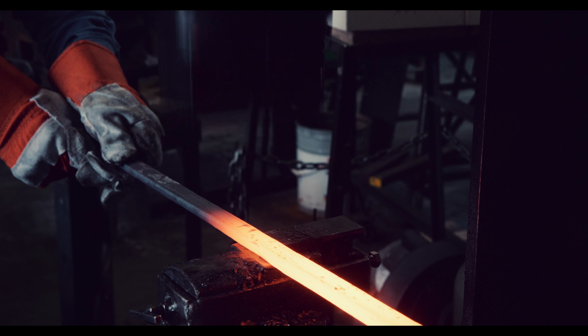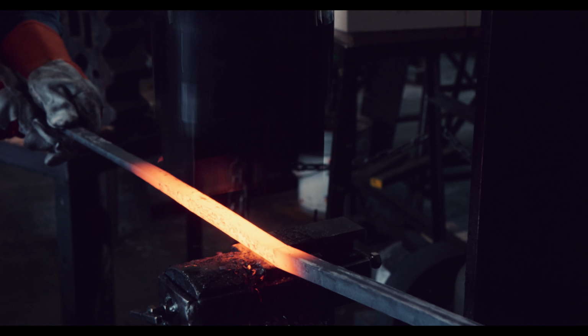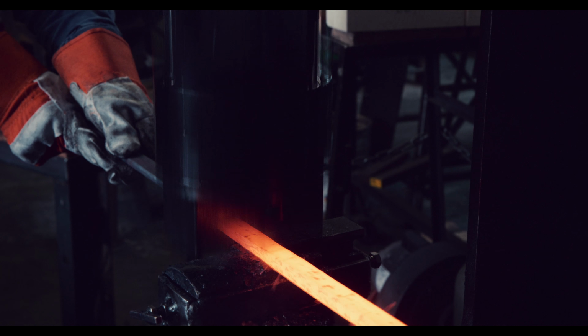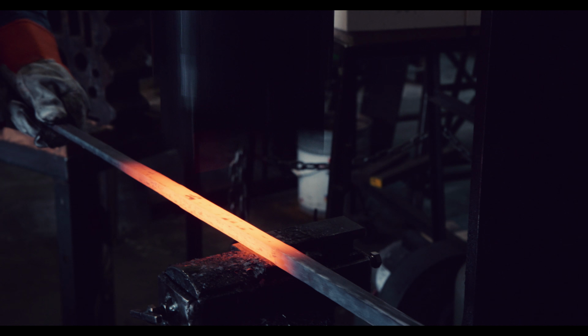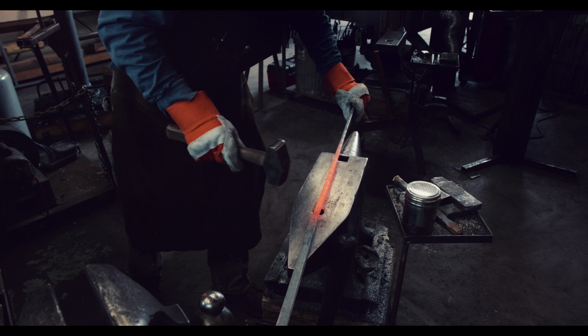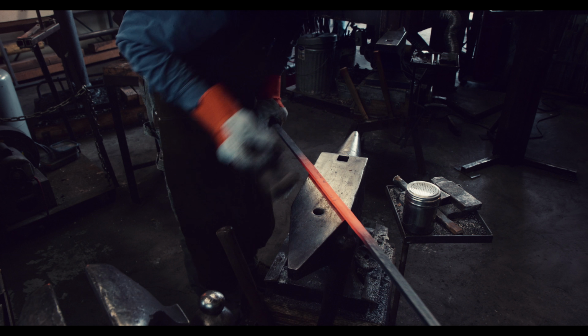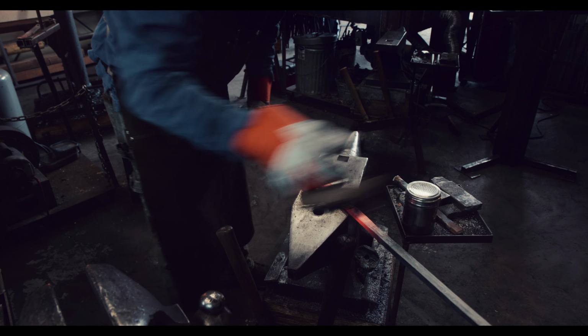The spacer on the power hammer makes it much easier to quickly get to the right dimension. However, care must be taken, otherwise the die and spacer will suffer. As you see, I have quite a bit of material. Instead of making a sax for giants, this will form the cutting edge for 2 blades.